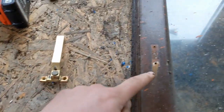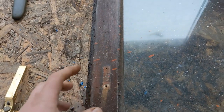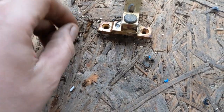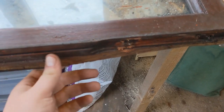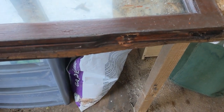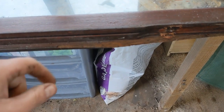I've removed the busted lifter and the handle because the handle is on the wrong side — that's for closing it when you're living in your house. I'm going to retain that handle and the little screws that go with it, and put it on the opposite side. Because the damage is where the lifter was — they broke it out when they weren't being careful removing the windows — I'm going to use the clean edge and put the hinges on there later.